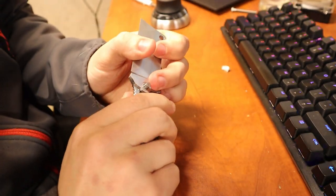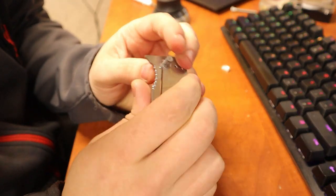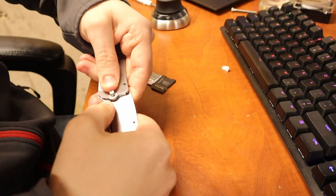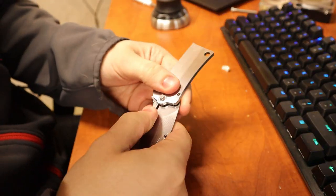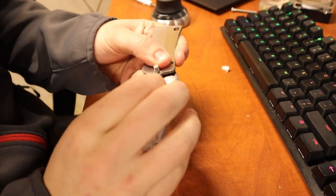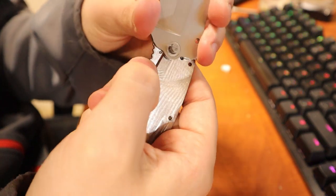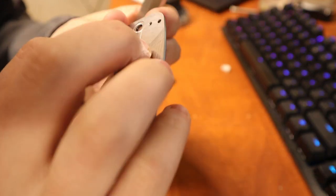So let's bend the actual lock up. Put a slight bend in our lock here. Okay, then we're gonna take this guy. Oh, I must have forgotten something, because I must have bent it inward slightly because it doesn't currently fit. Actually, you know what? It appears it's missing the cutout on the corner of the lock on this. See, it's hitting this inner corner right in there. It's supposed to have a cutout just really tiny on this edge.